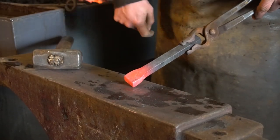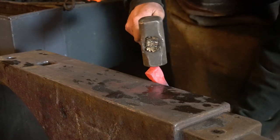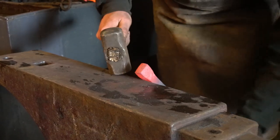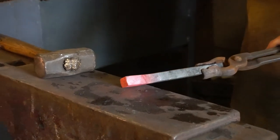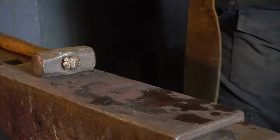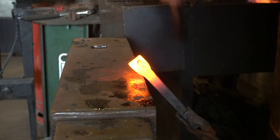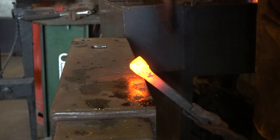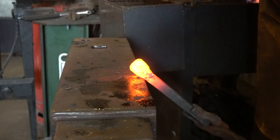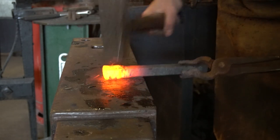The next stage is to round this end up. To do that, I'm going to drop it down onto the corner of my anvil, come in on the corners and we're going to go from a square lump to an octagon and then round that up. So nice and hot — over to the near side of the anvil and come in at 45. Just a little bit on each face to start with, and the same on that side as well. We're starting to end up with a little octagon on it.